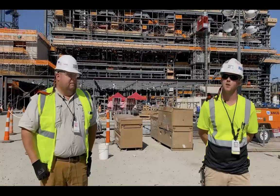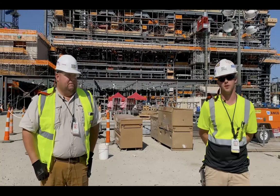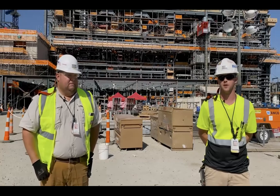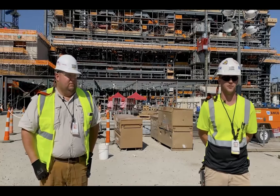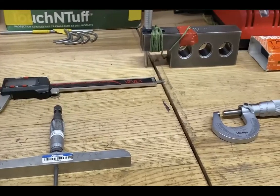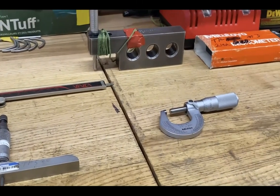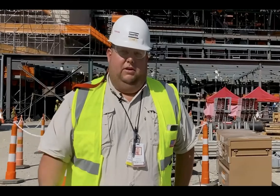All of those have to be aligned within a thousandth of an inch to prepare for the rotor to be installed. The wire is used for alignment of the diaphragms only. Most other tooling for this job is basic machinist tools — a mill rod tool, micrometers ranging from one inch all the way up to 35 inches.